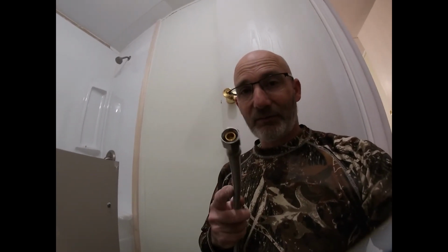With the 1/2 inch end, the 3/8 end, you're going to hook up to your shutoff valves. Again, in the application that I have, you want to hook them up and hand tighten them, turn them about 1/4 of a turn, and all that should go good. Hot water always goes on the left-hand side. Cold water goes on the right-hand side. I hope I know which pipe to switch here, but if I don't, I can always just swap them over, pretty easy. So here we go.